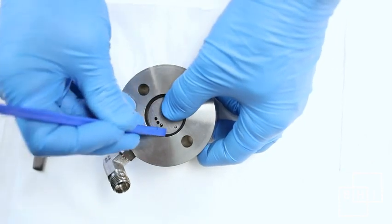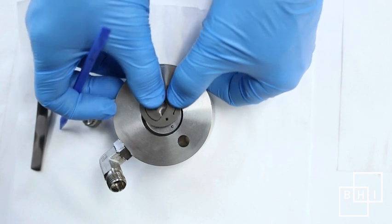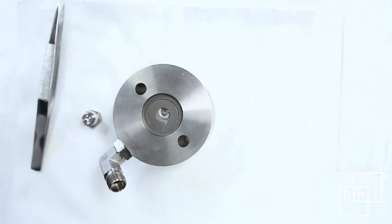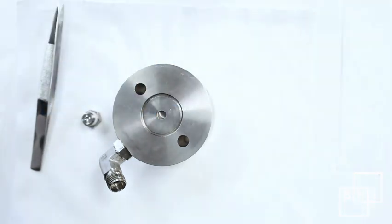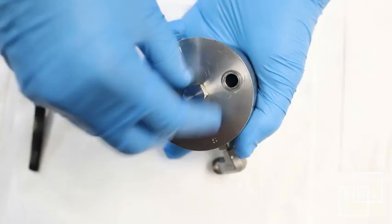Using a soft drift, push the O-ring into the groove. Place a reed valve on top of the valve seat so that the tail of the reed valve covers the three holes. Ensure that the pin is present in the valve seat. Place the valve seat cover on top of the reed valve so that the flat side is up. Place an O-ring into the recess on the valve seat. Insert the head plug and tighten by hand.